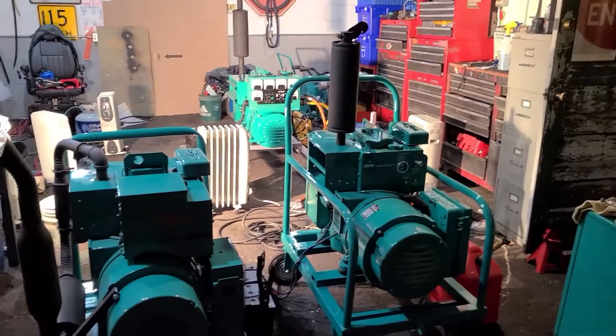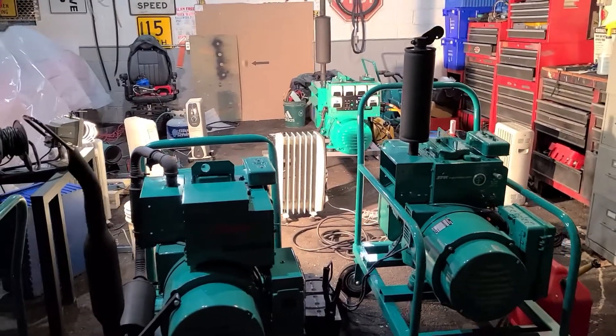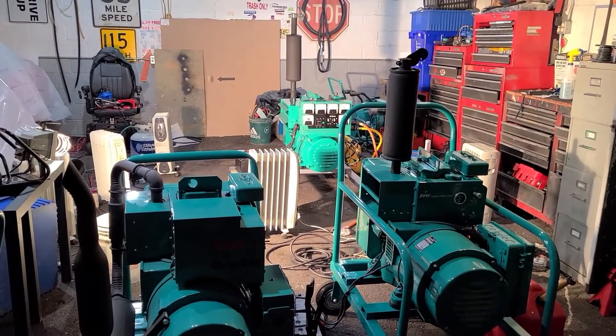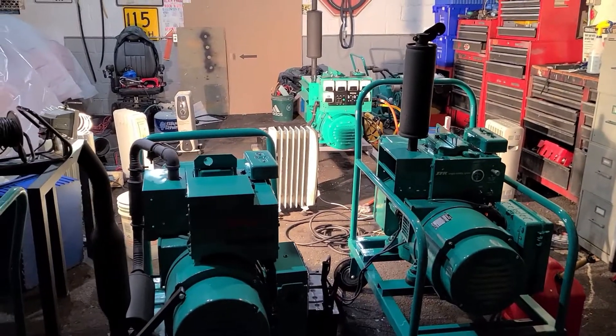All right, for this video I have no other heaters to add. I'll get about 45 amps on one leg and about 40-ish — 41, 42 — on the other leg. There is one of the heaters cutting in and out, so it'll dip down to 20 then go up to 40. I'm talking out here so you can hear me.